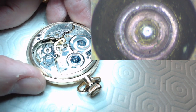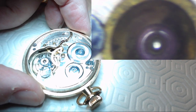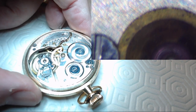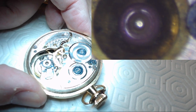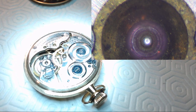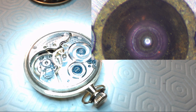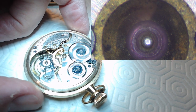If I scoot over along the train to the next wheel — everything is backwards so excuse me — that's the third wheel, and that's the pivot coming through the third wheel. You can see that's also dried up and gunked up. It's actually amazing that we're getting power from the train all the way through to the escapement with this.